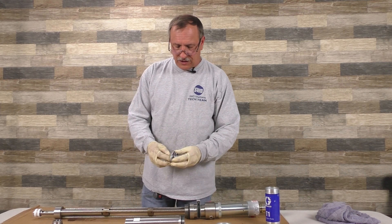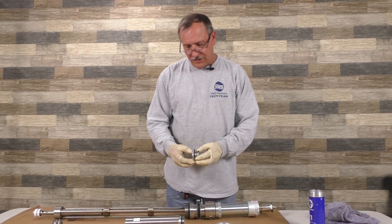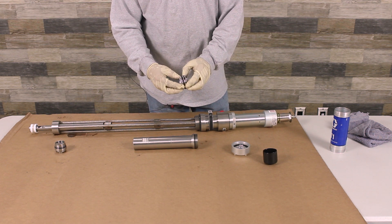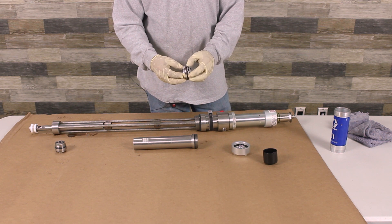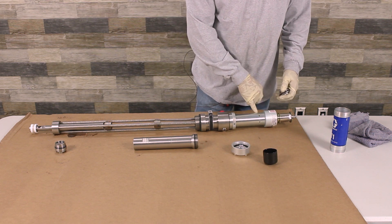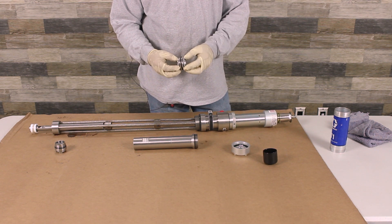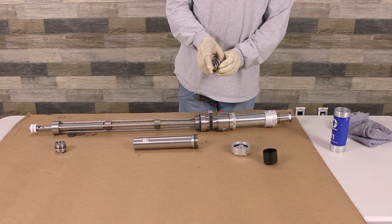One of the things I want to talk about is the air motor part, the top part right here. There are three little rubber washers — you'll see them. On some of the older ones, they have plastic washers and there's one in the middle. If these leak, you're going to get air coming out right in these holes right here, because it pressurizes this cylinder. These are easy to replace. This is what kicks the pump into its up and down motion.